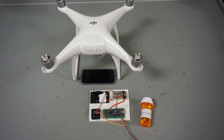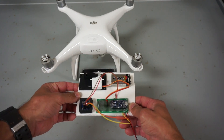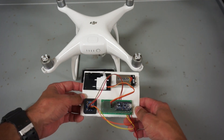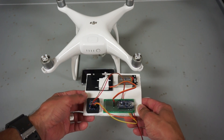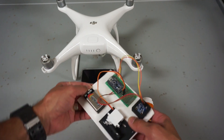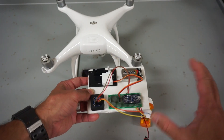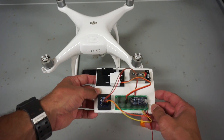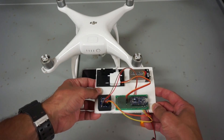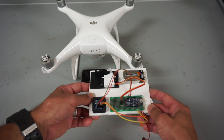So what I came up with — and I'd love your feedback; so far during testing it's done well — we have a compass on here. The idea is to add a drop block to DroneBlocks, and what that block will do is spin the aircraft 360 degrees in a clockwise rotation. There's some filtering: the 360 yaw has to happen within a certain amount of time at a certain speed, and if that's the case, the servo will trigger.